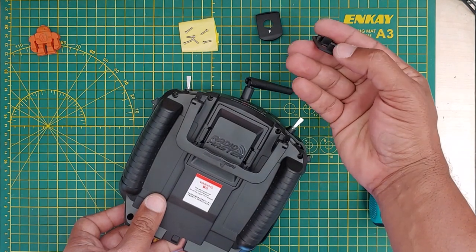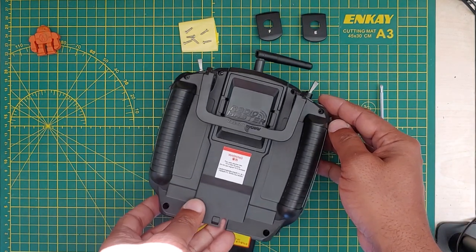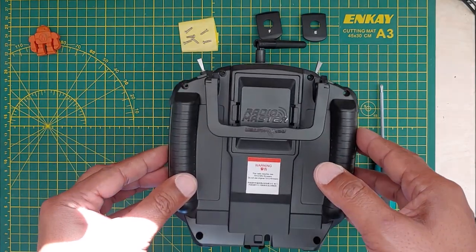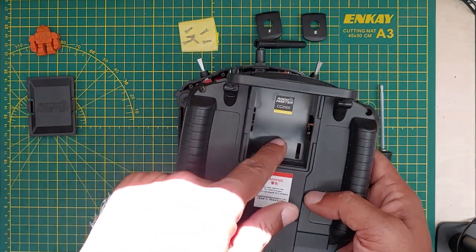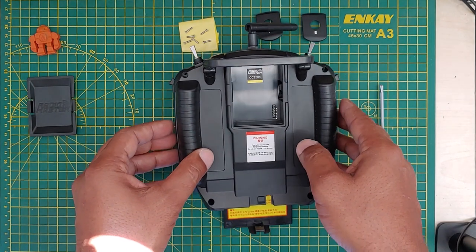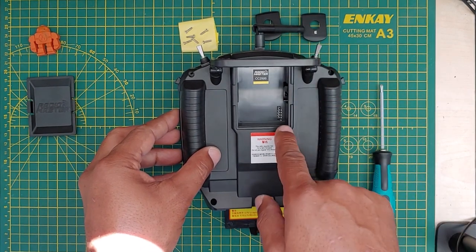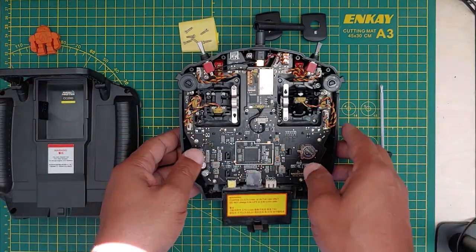You can see it's just a little tab that holds that in. Be careful not to break the tab — pull up on the back side, get your nail under there and it'll pop out. Now this should just lift straight out. Be careful: there are some pins on this side, so if you're nervous about that, open it so you can see when the pins come out. You don't want to mess that up because if you want to use an RF module later to expand your radio's capabilities, you don't want to damage that. Pull this straight out and set it aside.